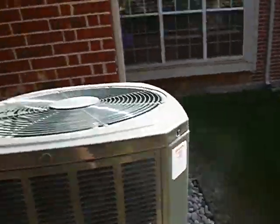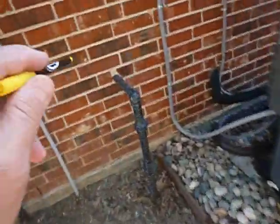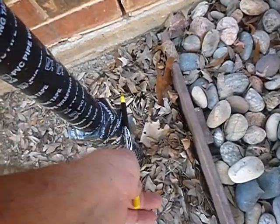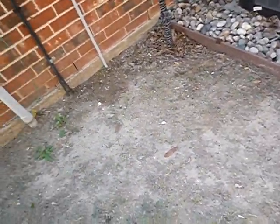This one over here is not very level. Gas enters the house on the west side — that's the main shutoff valve for the gas. If the handle is parallel it's on; if it's perpendicular it's off. That's true of just about any valve like that, and that includes your water valve we're about to watch in another video.